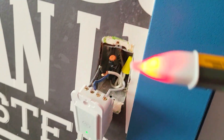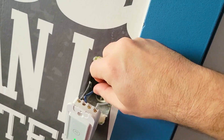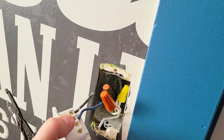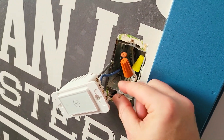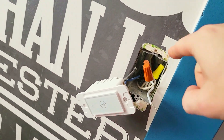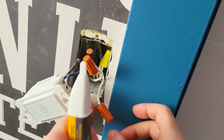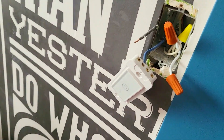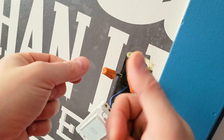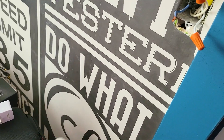Nothing, nothing, nothing — and of course that one does have power. This is your ground, so you can touch that one no problem. Now we're going to take our neutral — it came out, and I can touch it because there's no power. Make sure these don't touch the metal or any other cables. Now we'll take out our load — it came out quite easily, also nothing there. Be gentle with old cables because bending them can cause them to crack. And finally the last one — carefully, came out no problem.